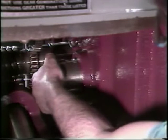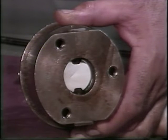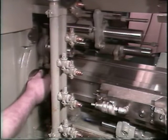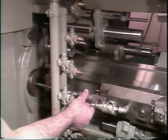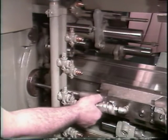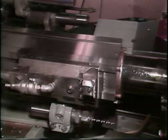Attach the draw rod stop block to the power case wall. The block has spring-loaded pins inside. Slide the draw rod through the block. Then attach the stop nut and locking nut on the rod end.